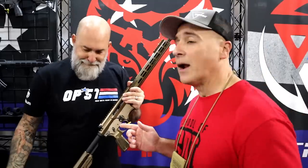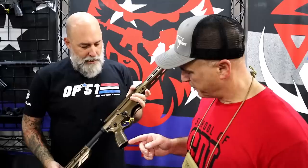Let's take a look at some of the additional features — I like what I saw yesterday. First and foremost, we took an inch out of the magwell. Let's get a little closer to the camera. You can see there — we took an inch out of the magwell, flared it, and put a real deep chamfer on it. This gives you a much shorter lockup time on your mags — it's just right in and out. You don't have to jam it in there or hit it to seat it. It's literally just in. We just wanted to make the best AR possible that 90% of the world could afford and would never need to upgrade.